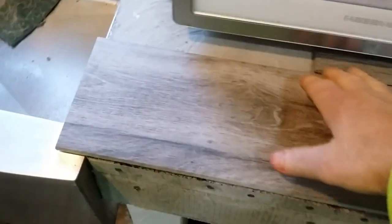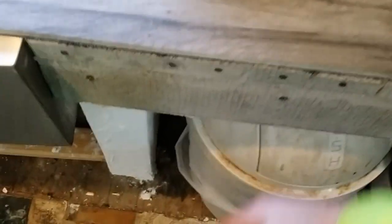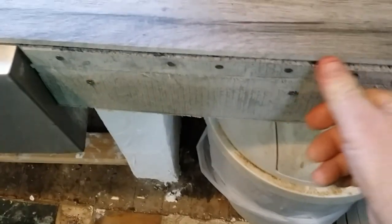Down there we're putting shelves — shelves will go there. This tile here is plank tile; this is going to go down in a running bond pattern — some will call it a brick pattern. We're going to have this on the face, and this will overlap that way. The top of this, where the face tile will be level with this one — these are six inches by 24. Then for the backsplash we're going to put one tile going all the way around, so this will all get the same thing.